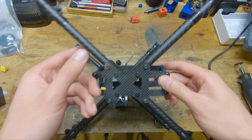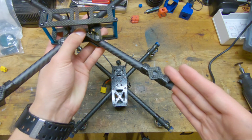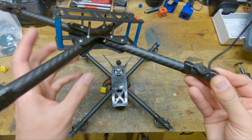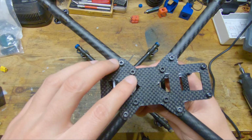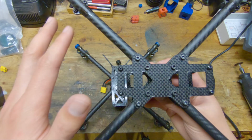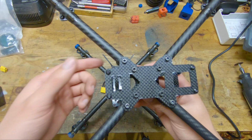What this does is it decreases the length of the arm so that any force imparted on the end of the arm is going to have a shorter lever arm, and therefore will induce a lower stress on the screw holes. Another thing that I did is I made the distance between the 2 screws slightly further apart, which reduces kind of the couple moment effect here and further reduces the stresses.